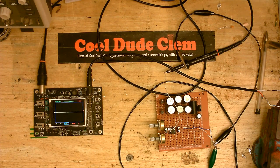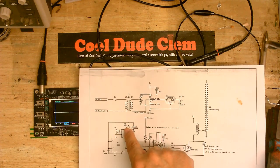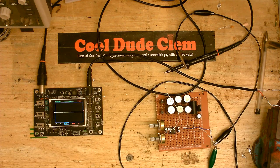I've built the Triple Five part of the circuit. I had to improvise a little bit, because the original schematic calls for a 100 kilohm variable resistor and a 200 kilohm one. Well, I don't have a 200 kilohm variable resistor, so I've just had to make both of these 100k. It should still work, though — just won't get the range that the original circuit would give.